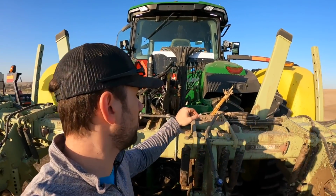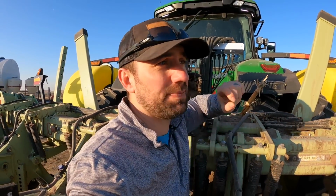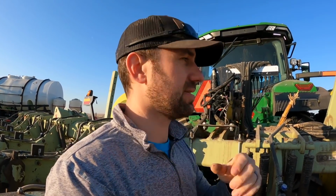Once again, we're using what we call orifice tubes. It's these little guys. It's 8 foot of a certain diameter tube, and that's what causes the restriction. Usually you have a little disc with a little pinhole. Well, these tubes allow bigger chunks of contaminants to flow through, which you always get, and it's a better system than the old orifice tube or the orifice disc, in our opinion.